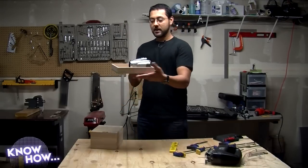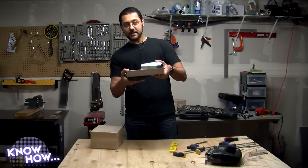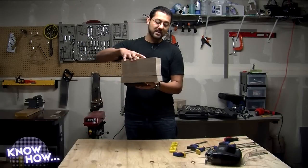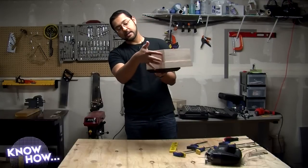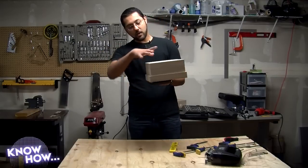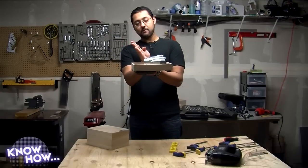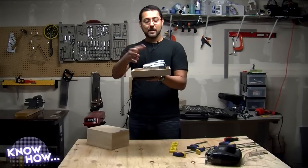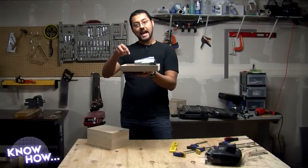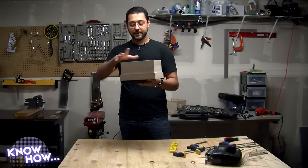We're going to have our camera in this part of it, the lid itself. We're going to attach this 7-inch USB monitor to the base here. Obviously, we have to have a cutout for the monitor. And then this, the actual box, acts as a hood. Now, what we have to do is cut out a piece so the camera can look out. We have to cut out a bit in the back so we can route cables. And the reason why we're doing this hood style is because we want to block any light coming in. When you have that reflective material that we'll have in between, it might be glass. In our case, it'll be plastic. You don't want any light coming in because then the camera will actually see the text that's going by. So this will effectively block out all the light.